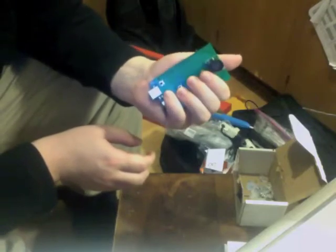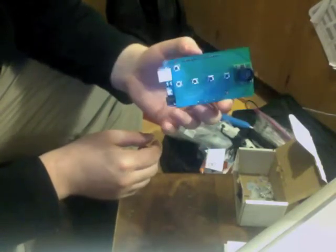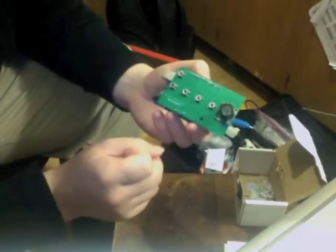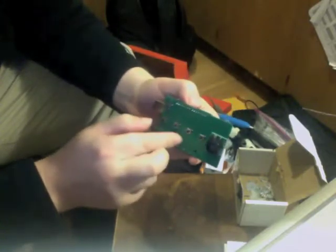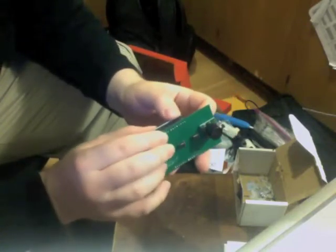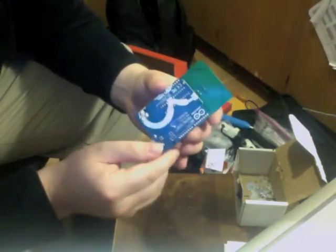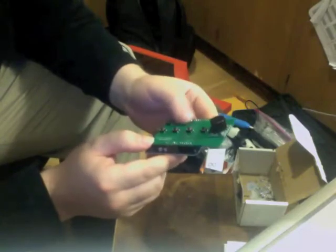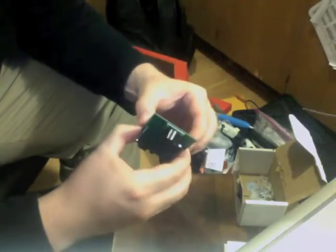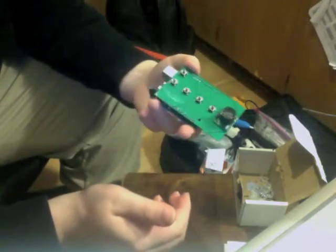Can we use it directly like this? Not really. I have a driver written by my friend, the genius Michael Krasaniak, that works on the Macintosh only, but it also seems to only work with the Duemilanove Arduino — and I don't even think they make those anymore. So this is a UNO, and it is not going to work with that driver. We are working on a way of making this class compliant, because the UNO has the theoretical capability of being a class-compliant MIDI controller, but that is something currently in progress. Hopefully soon this will be usable as is, however at the moment I can't use this as is.